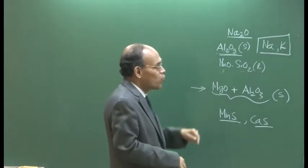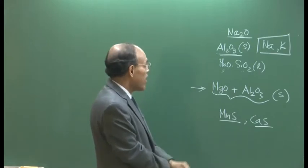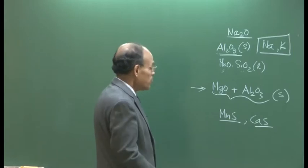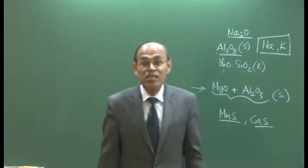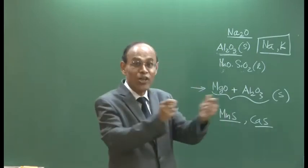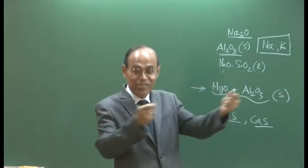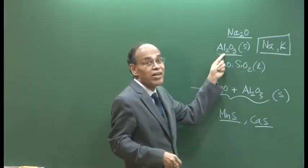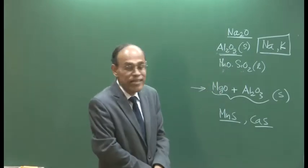So, various kinds of inclusions we will see in steel, and as I said, their sizes are not going to be appreciable. Some of these inclusions are deformable, some are non-deformable. You can imagine that if the inclusions are non-deformable, then when you apply stress on the material, what is going to happen to the inclusion? And these inclusions are non-coherent particles, okay?